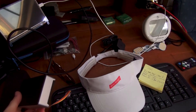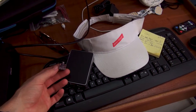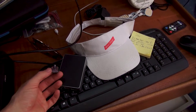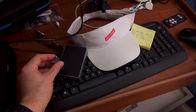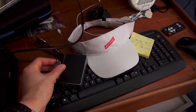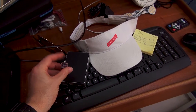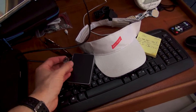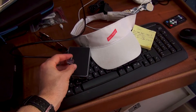I'm just waiting for this to dry and then I'll start packing up. I did work on my Raspberry Pi temperature, humidity, air pressure, and volatile organic compound sensor kit. I'm having some trouble getting it to authenticate with the marina WiFi, so I might write a script to auto-authenticate every six hours or so. The plan is to be able to see this data remotely — temperature and humidity are the most important, and air pressure and VOCs are just interesting. Carbon monoxide is considered a VOC, so it'll pick that up too, though it doesn't differentiate between carbon monoxide and other VOCs. For instance, if there were a diesel spill, it would pick up compounds being gassed off.